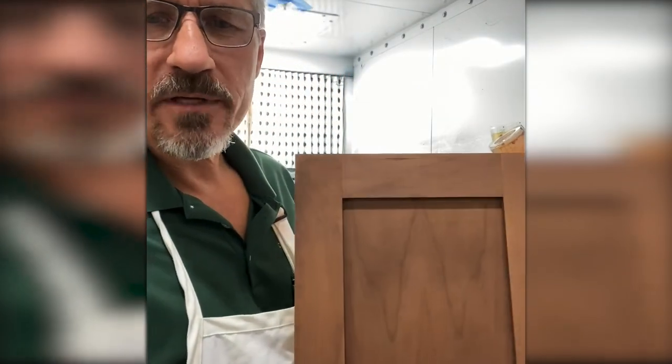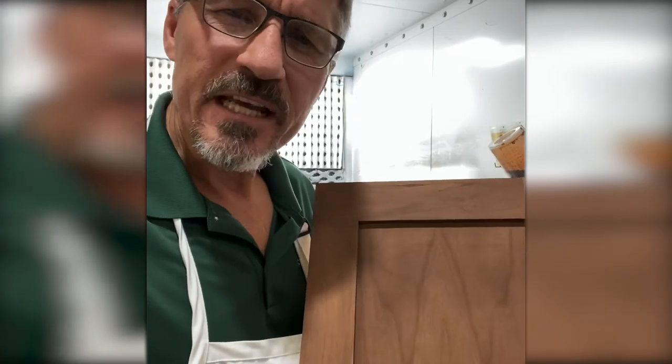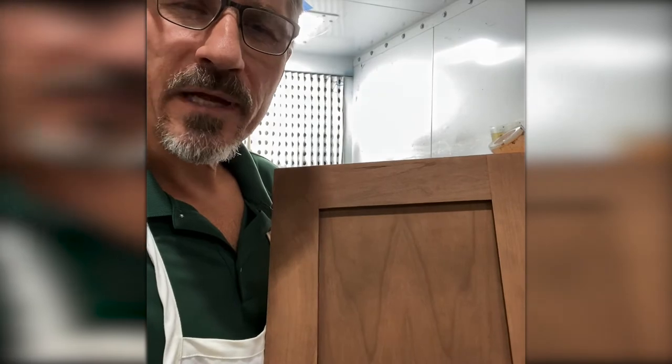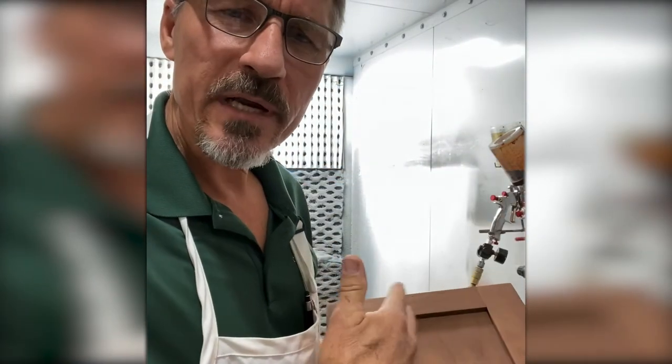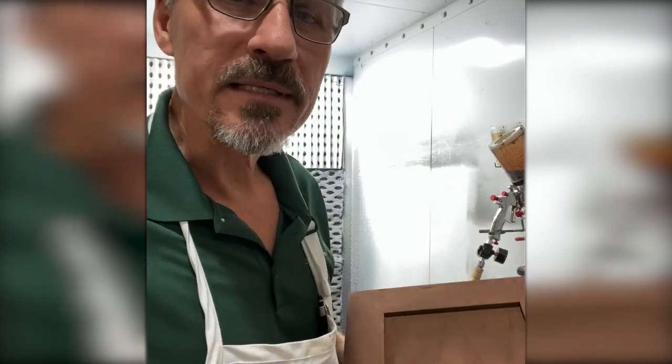So I'm going to let this door sit for a few minutes and come back to show you what it looks like when it's done. I sprayed the door and it's been sitting about 15 minutes. Here is the door now completely dry. It's about 78 degrees right now, so it dried rather quickly. And again, all ready to apply a clear coat. I'm going to go ahead and spray some pre-cat lacquer over some of our Magnemax on here, so you can see how the product looks when completely done.